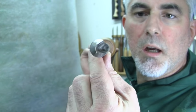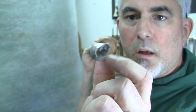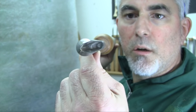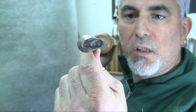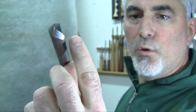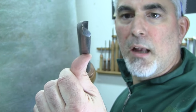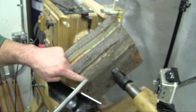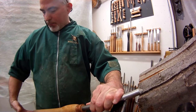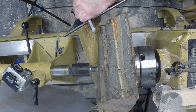Probably the most important part of this cut is to make sure your bowl gouge has the right attitude — we want the bottom wing to be horizontal. As you get a little bit better with the cut, you can turn it up a little bit; that will speed up the cut. But to start, you want to have that lower wing perfectly horizontal. Then, keeping that same attitude with the flute, we are going to drop the handle a lot. So the flute is still horizontal, it's just facing uphill at this point — flute horizontal and then drop the handle really, really low. I have my tool on the tool rest, my bottom flute is horizontal, I'm dropping the tool, keeping this extra-long handle right in my hip, I've got my palm on the tool rest, I'm cradling the tool with my fingers — there's my pivot point.